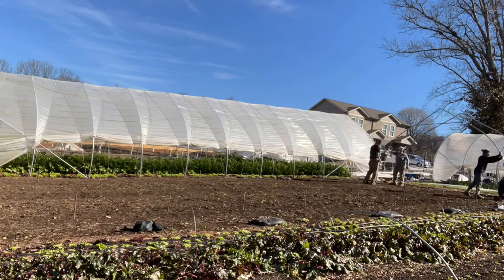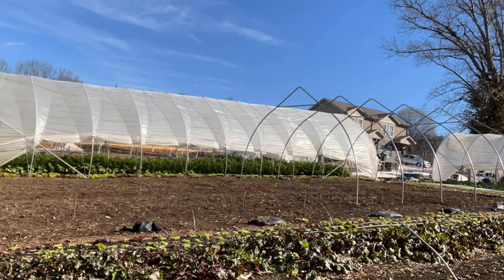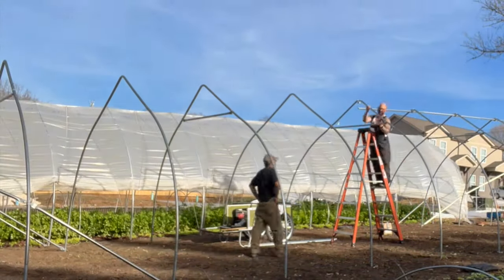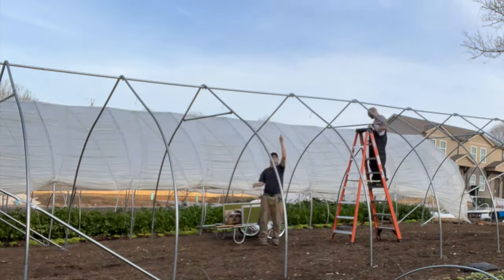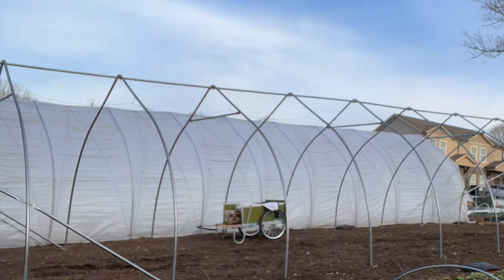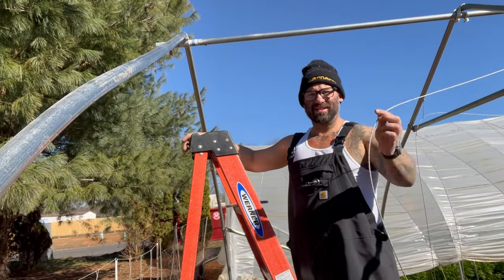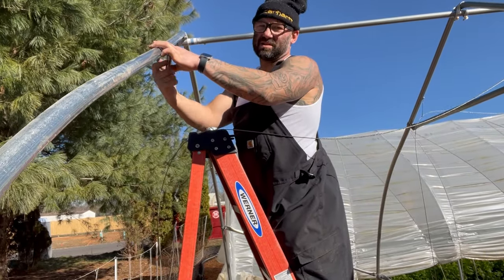My friends and I just walked the hoops into place. The entire process up to this point took about two hours, and the skeleton of the structure was up. Next I installed the center purlin down the middle, left it loose, then went back and tightened everything ensuring they're all exactly 5 feet apart. Once the center post was installed, I zip tied the irrigation lines for the sprinkler system to the pipe. It's much easier to install additional hardware like irrigation or trellising wire before you put the plastic on. I also installed trellising wire at this point because I'm planning to grow indeterminate tomatoes in this tunnel next season.